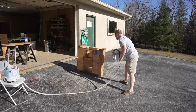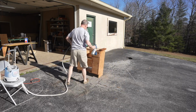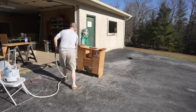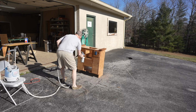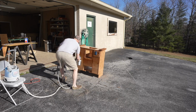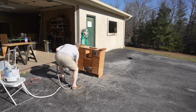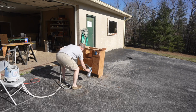There was a surprisingly small amount of dye in the can, but it went a long way toward evening things out. That's typical of dye. Another thing I like about dye is that the second coat will really make the color rich, but it never muddies the grain of the wood. That's one thing that you can't say about a stain.